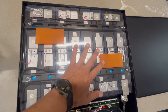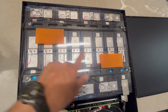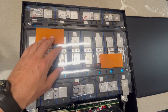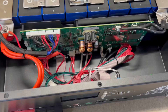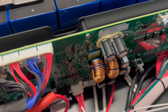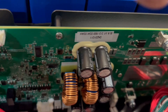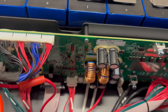So we've got a plastic sheet over all the cells, and these just look like two little sticky insulators — but this is actually the fire suppression. I'll tag a video so you guys can see how these work. Those are the two fire suppressors there on the plastic sheet. Focusing in down where the BMS is, I don't recognize this BMS, but it does list it as a 100 amp BMS, so I definitely have to test that 120 amps they list online.